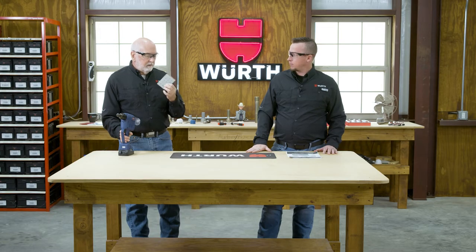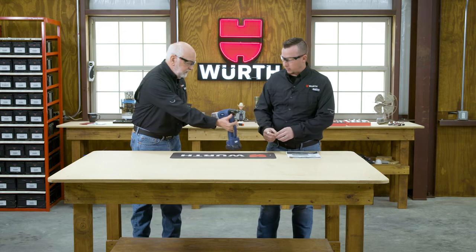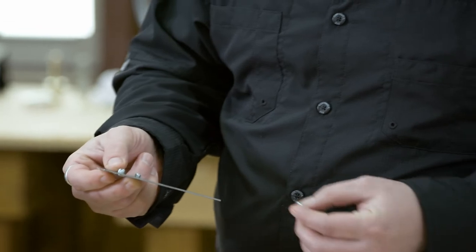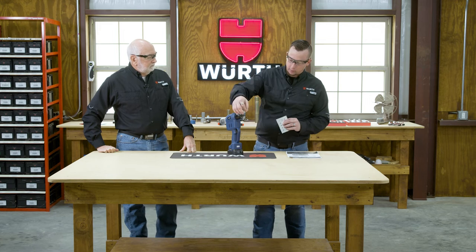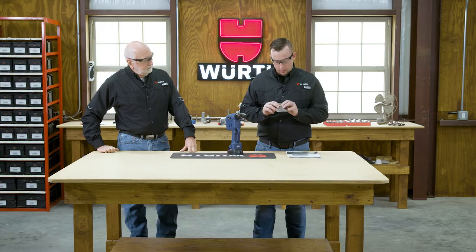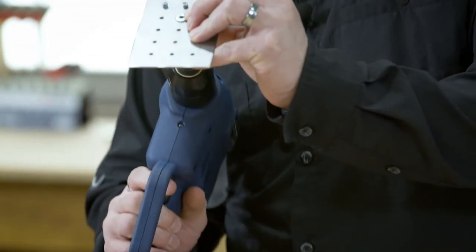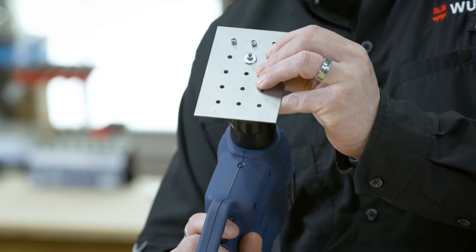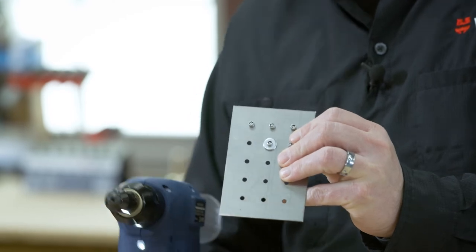Absolutely. Now, there's another thing that you can do. You have a washer there, which is what we call a backup washer. So you can use the backup washer. We're probably pretty close here, but I think this will set correctly. So again, we're going to place the mandrel inside of the tool. Be careful here, just ensure that I've got that mounted correctly. I always face this up, typically. The mandrel falls back in. You can kind of hear it fall back in the keeper, which is nice. And there it is, pulled right through. Simple, isn't it? So simple, so quick.